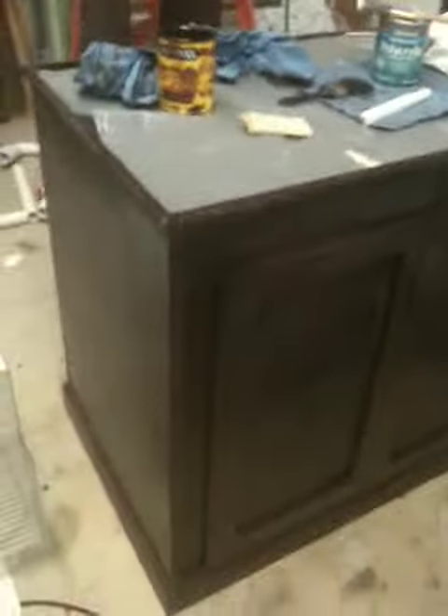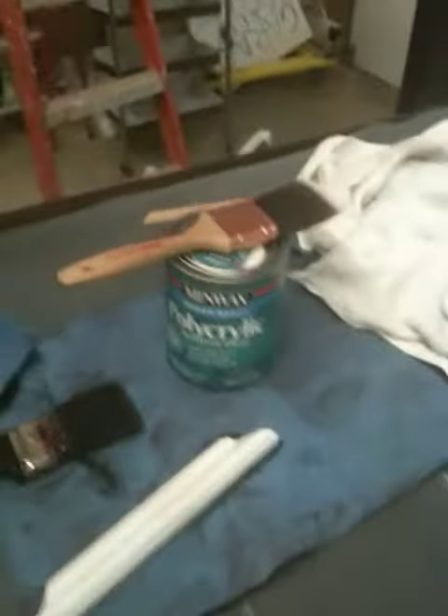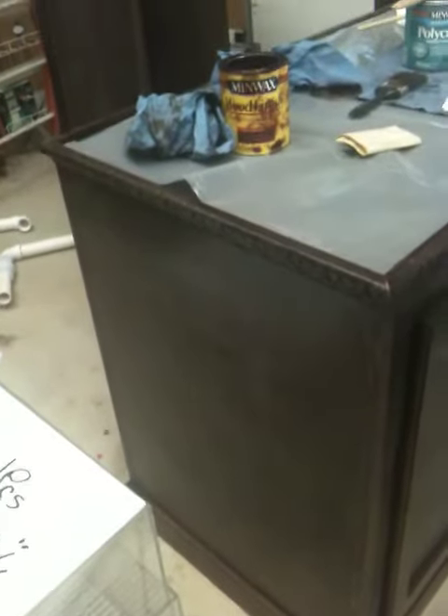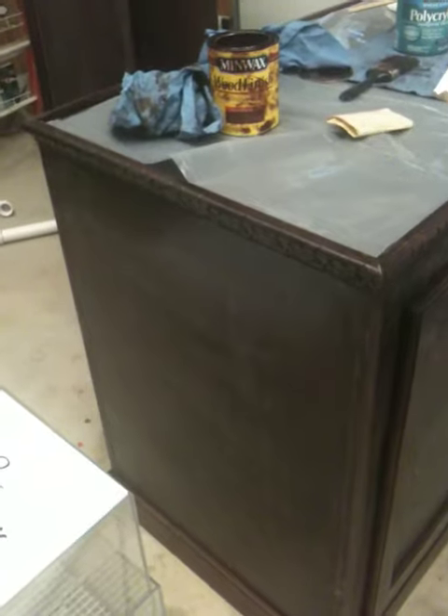How it works is you put a coat on — you paint it on. You want to get a synthetic brush, something with nylon bristles. You just go and paint with the grain of the wood. If you have two different pieces butting up to each other with different grain patterns, you just switch up your brush stroke. It kind of fills in any uneven spots or pores in the wood, so it's going to make it smooth after a couple coats.